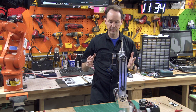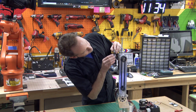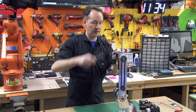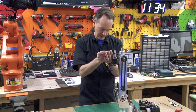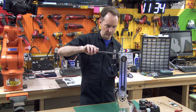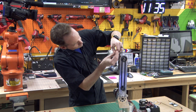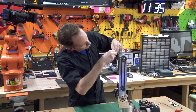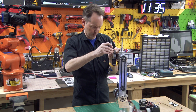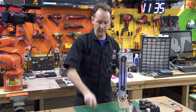All right, we got it. Oh — I've got to do this. Hang on, I get to fight that thing again. So if you try and tap this on to get that extra little millimeter, getting it off is a bit of a fight — so be gentle doing it. I levered in there with a pair of needle nose and it did just fine. We'll get this pulley back in here. Finger tight plus a quarter. All the way in. Okay, we're good there.